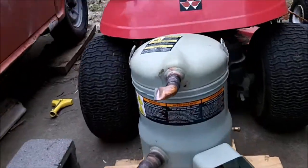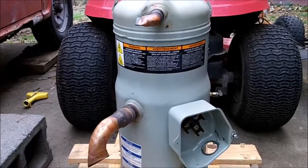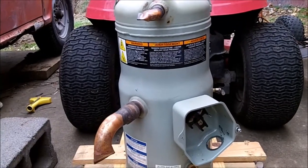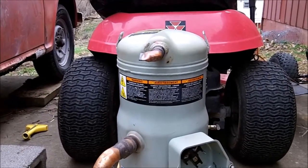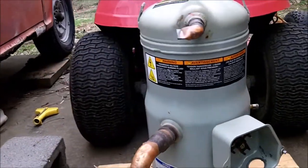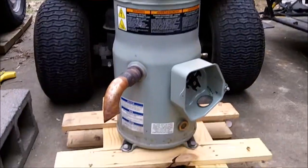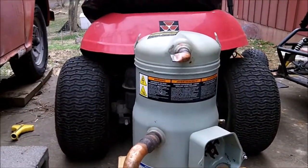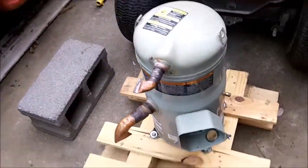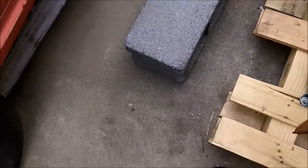This video is going to be about a Trane HVAC scroll compressor. I got it brand new — it's still sealed up from the factory, still has its nitrogen purge inside. I'm guessing that's about 5 to 10 pounds per square inch. It's brand new, never been used, but it's defective, sadly. It came on the pallet from the factory. I'll show you shortly what is wrong with it.